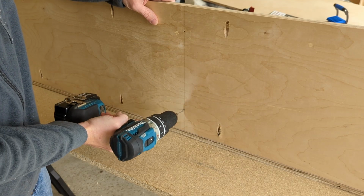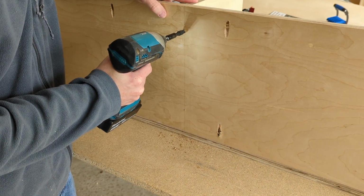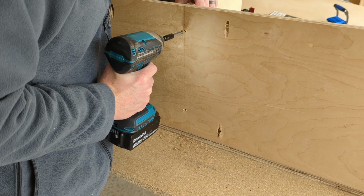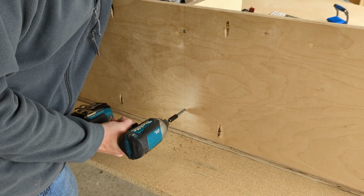Then I drilled 2 pilot holes on the lines I drew earlier for the shelf partitions. I decided to countersink the screw heads even though they won't be visible when the bed is complete. My goal was to avoid the possibility of anything getting snagged on them during use. I fastened the dividers to the back of the bookshelf using 1 1/4 inch wood screws.